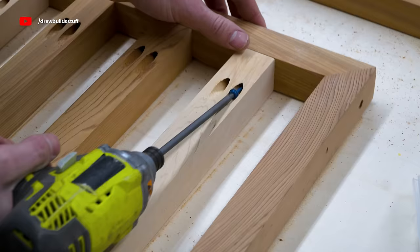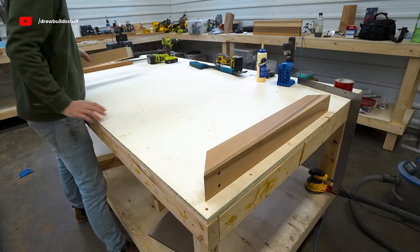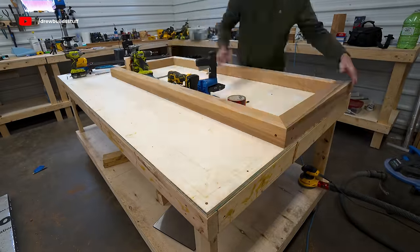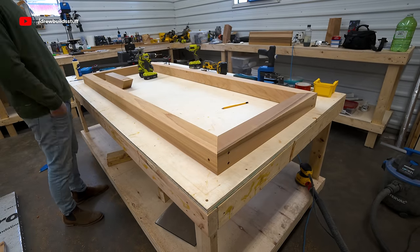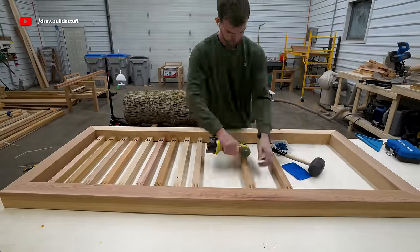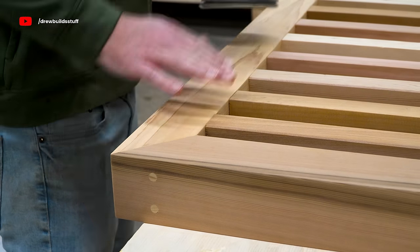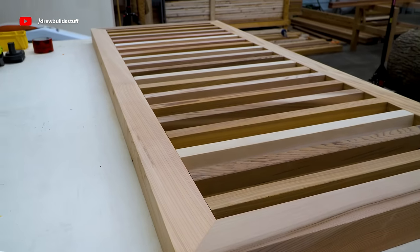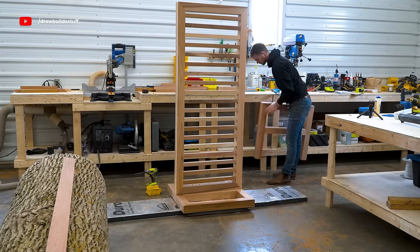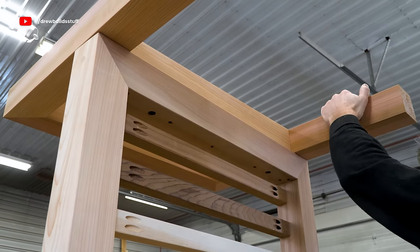For the bench I'm planing more four-by-fours down to the same three-inch thickness. The outer frame of the seat is framed with four-by-fours instead of two-by-twos because this could potentially support the weight of four bodies — at just over six feet long the two-by-twos wouldn't be nearly enough support. Then the same way as before I put in two-by-two spindles using pocket holes for a completed seat. I screwed on the legs the same way as the chairs, but I'm also using a couple of 5.5-inch structural lag bolts — two in each end — so it can support a lot more body weight.